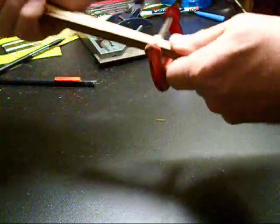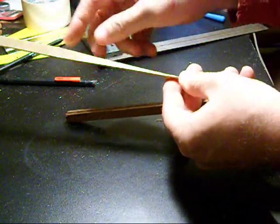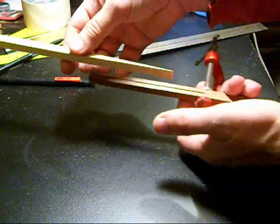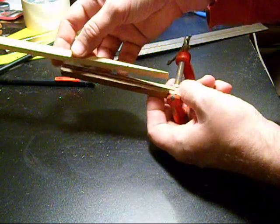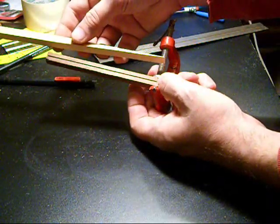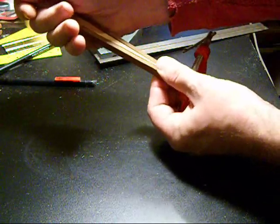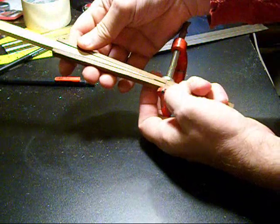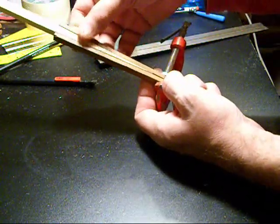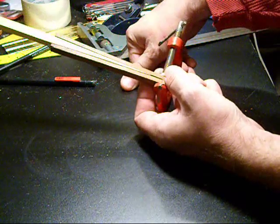You can see the way these parts slide together. After cutting it on the bandsaw, I took a block sander and smoothed the sides — it was pretty close. When I glue this up, this little end here should seat without a gap. This is a dry fit — there's no glue, no lubricity yet, so it's a bit difficult to get it all the way down to that point. Once the glue is on there, it will be slicker and go all the way to the end. I'll glue this up next, clamp along here, and let it dry for about six hours.